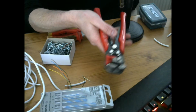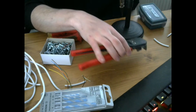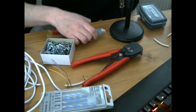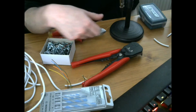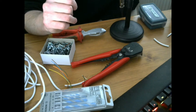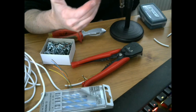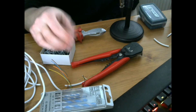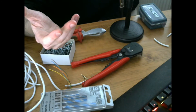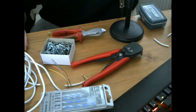I would recommend this cable stripper tool — it is about 30 pounds from Screwfix. Basically this will also strip mains cable. If you have ever tried to do mains cable with cutters it is very laborious because you have to go round the outside with little nips and then pull it off. This will just strip it straight apart. You can also cut it to the correct length because mains cable doesn't have the thread. You have to cut it to the right length, then take the white sheathing off from where you are going to put it into the mains feed.